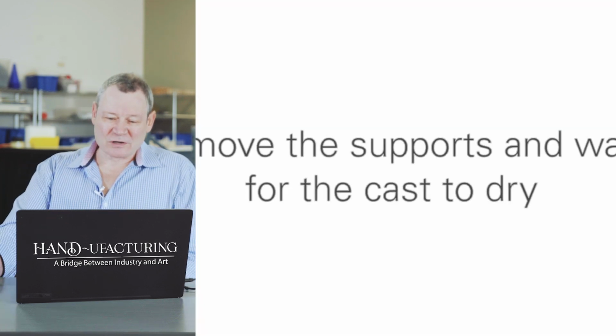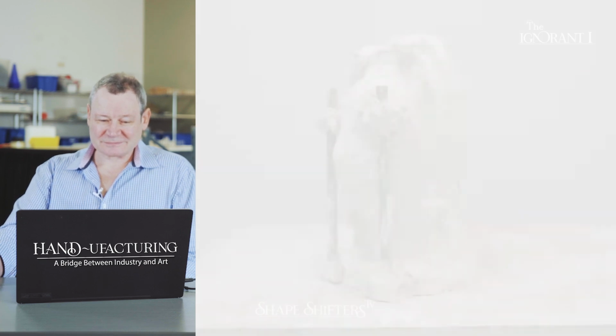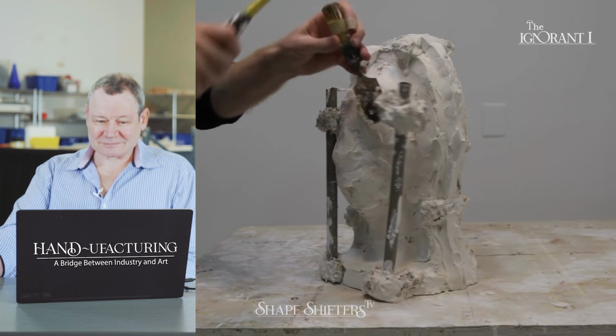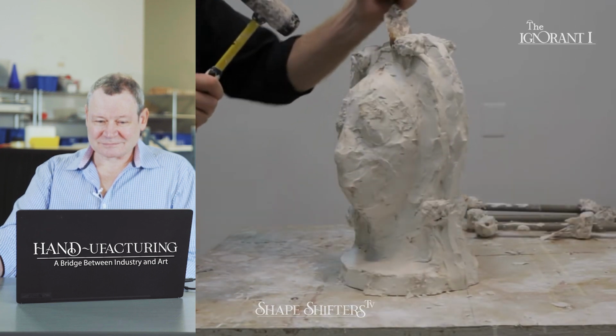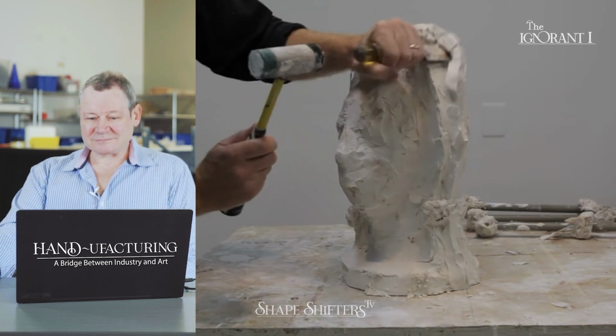At this point, it'll work best to wait at least an hour to make sure that the poured plaster is sufficiently set inside the mold. Then we can begin to remove the supports, including the supports that hold the two halves of the mold together, and also chiseling away the seam of plaster.